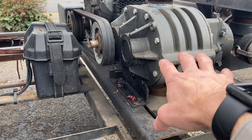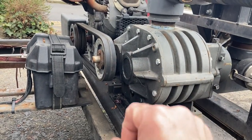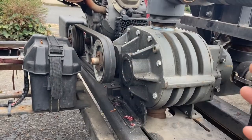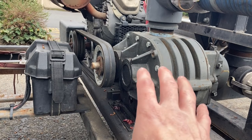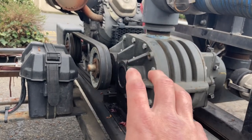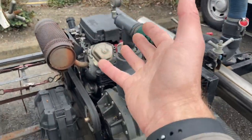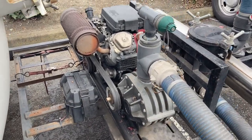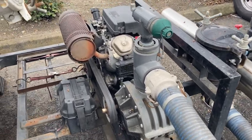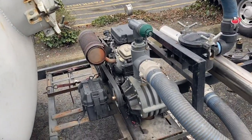And I have one of these blowers that is starting to rust out and seize up. So we're going to be doing another video where we take one of these blowers apart and sandblast it, clean it all up, put in new bearings, new seals, put it back together, and put it back in service. That's a whole process. We can do it in about a day. But if you get into this kind of work, you're going to have to learn how to do this if you don't want to be throwing thousands and thousands of dollars away at new parts and maintenance. You can just spend $100 and rebuild the thing and take a few hours of your time and save yourself $1,700 on something that's going to happen to you about every 2 or 3 years, depending on how you take care of these things. And when you're running multiple blowers, you wind up doing a rebuild about every 6 months on one of your systems.